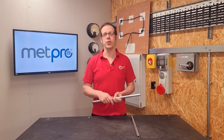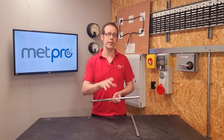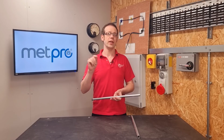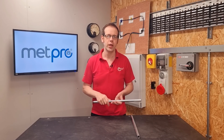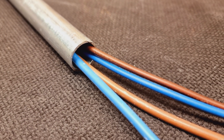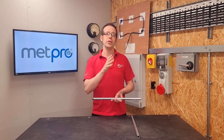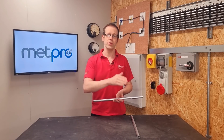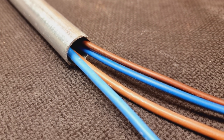Generally speaking, we size our line conductors to cope with either the design or nominal current in the circumstances they're installed in, and sometimes we beef them up to reduce volt drop, but only occasionally do we size them for short-circuit current. If you're running a couple of circuits through the conduit - say one for lighting and one for power - then Regulation 543.1.2 comes into effect. This states that where a protective conductor is common to two or more circuits, its CSA shall be calculated for the most onerous fault current and operating time, or selected in accordance with 543.1.4 to correspond to the largest line conductor. So using the second method, we'd need to use the largest line conductor in the conduit for our check.